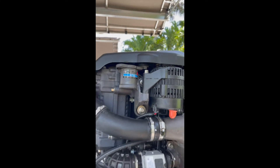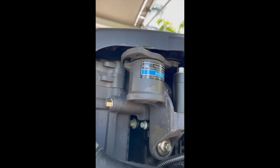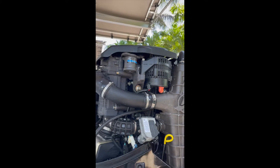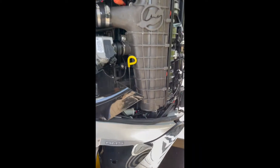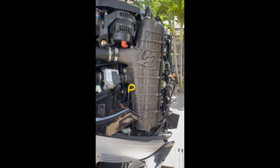There's an idler arm right here — a tensioner arm. This is actually the tensioner arm assembly right there, and that would be replaced during a 100-hour service. That belt right there — I didn't take the cover off, so the only thing under there is the belt.